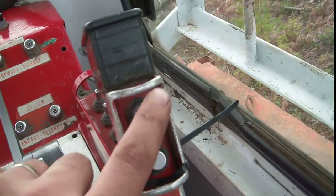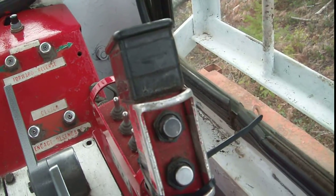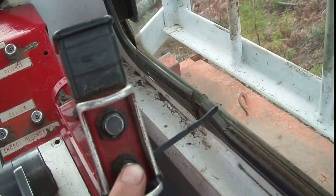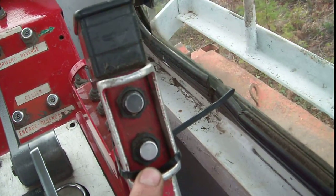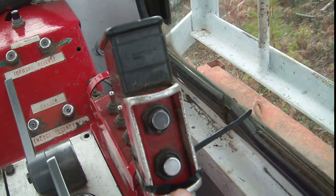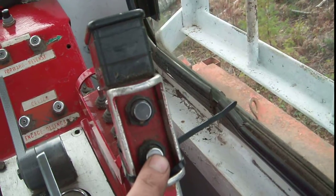If you click the top button once, that puts the Skyline brake on the carriage. Click it once again and it sends slack to the guys in the brush. A short and a long on that top button is fast slack. Two clicks on the bottom button will open the skid and line clamp on the inside of the carriage so I can pull drop line through it. Three clicks down there will open the Skyline clamp so they can send it all to the landing.